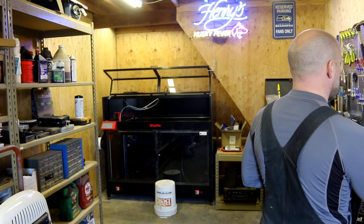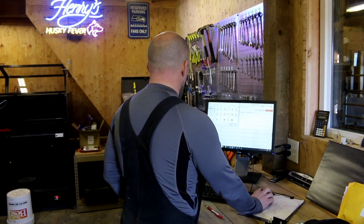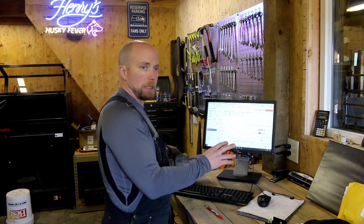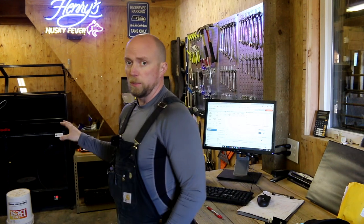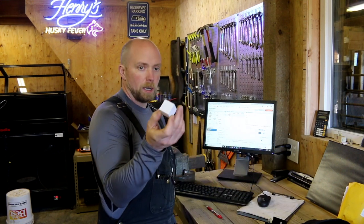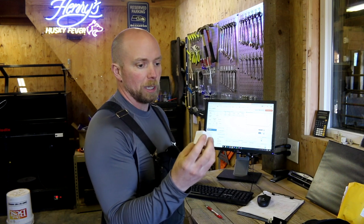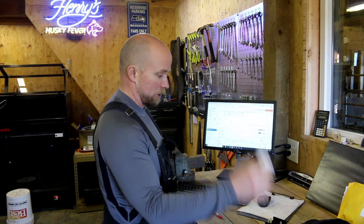Booyah — we are ready to do some prints! Now we're uploading the cube test at 1mm. Magical pixie dust is moving from this computer over to the 3D printer — it's uploading and heating up the element. The bed is already heated. We're printing another test cube; I sent pictures of the last one to Modix and they gave me feedback. Going from 0.4mm to 1mm nozzle, it should go a lot faster.